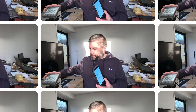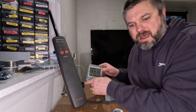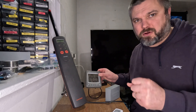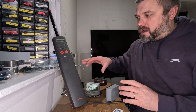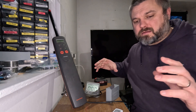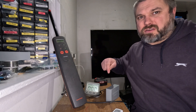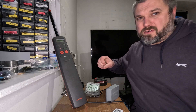I'm going to hopefully show it working now with the ST60 timer. Basically, if you're in a race and you've got one of these speed displays, you can set timer mode and get a countdown. The main thing is the autopilot — I have an ST1000, and this works with any of the SeaTalk autopilots: the ST2000 and a pile of other ones. I'll stick a list of the ones that use the old SeaTalk protocol down below. If it's on that list, it should be fairly straightforward to get it working.